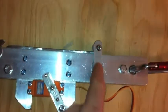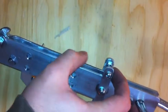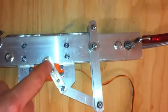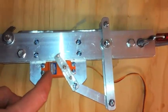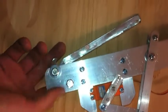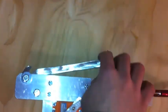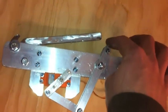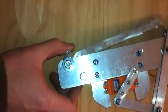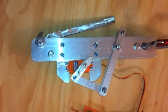This is the actual release mechanism here that latches against the actual hook — I'll show you that in a second. You can see there's some mechanical advantage here with the leverage back to that servo, so this servo really doesn't work very hard even under heavy load. So I'll go ahead and actuate it — that lifts up and you'll see this hook piece flies out. That's also got a lot of leverage, so there's very little friction when it's resting against the stop. This is the hook where you actually hook on the bungee or the payload.